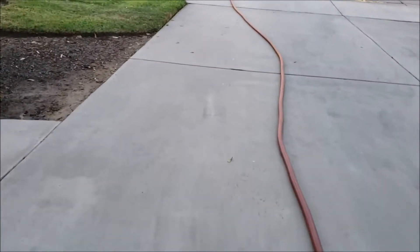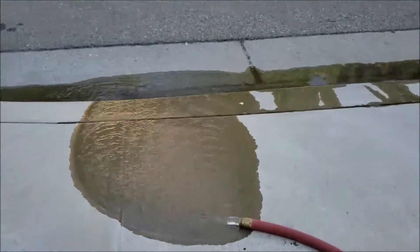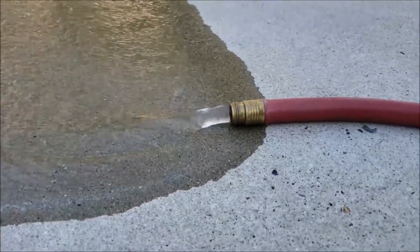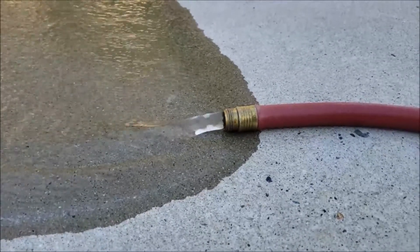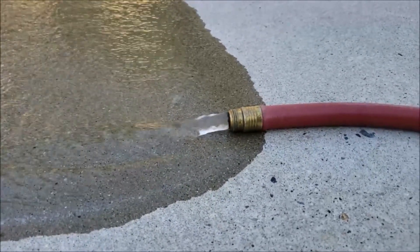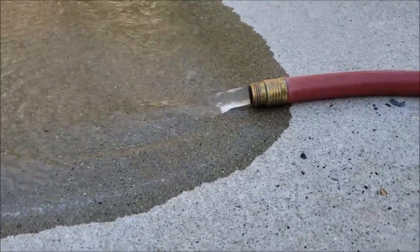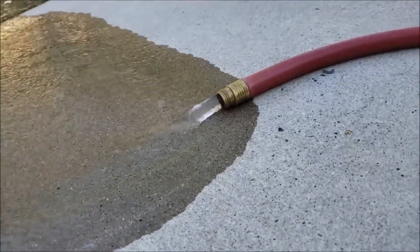Good flow out here — and that's because it's a new water heater. When you get an older water heater that's been in there 15, 20, 25 years, what'll happen is you go to drain it and you won't get flow like that. Right now it's just gravity draining — no pressure because the cold water's turned off. But with older units, it'll just be trickling because sediment has built up so severely it's blocking that hole. That's more typical with plastic multi-turn valves that get clogged. Anyway, it's draining well — we'll wait for it to be bone dry and then show you how to get it back online.